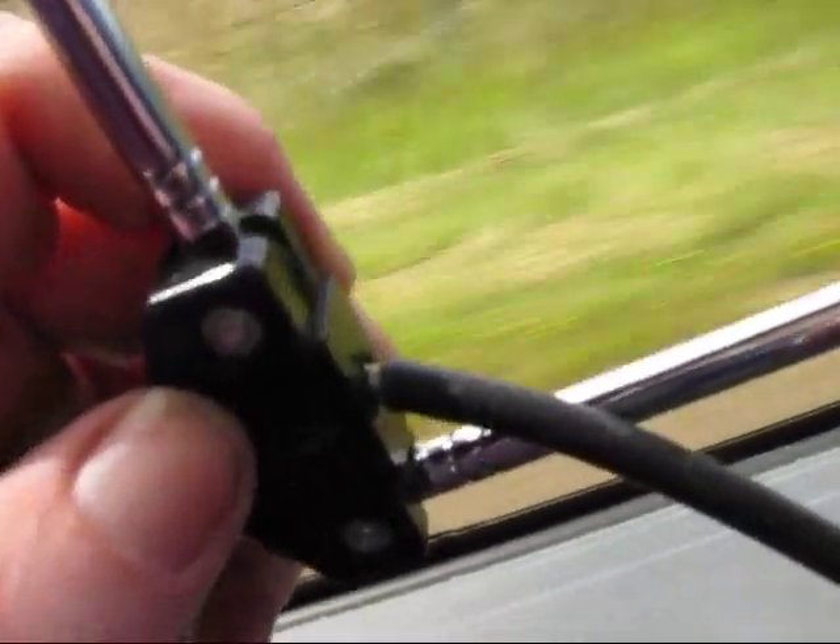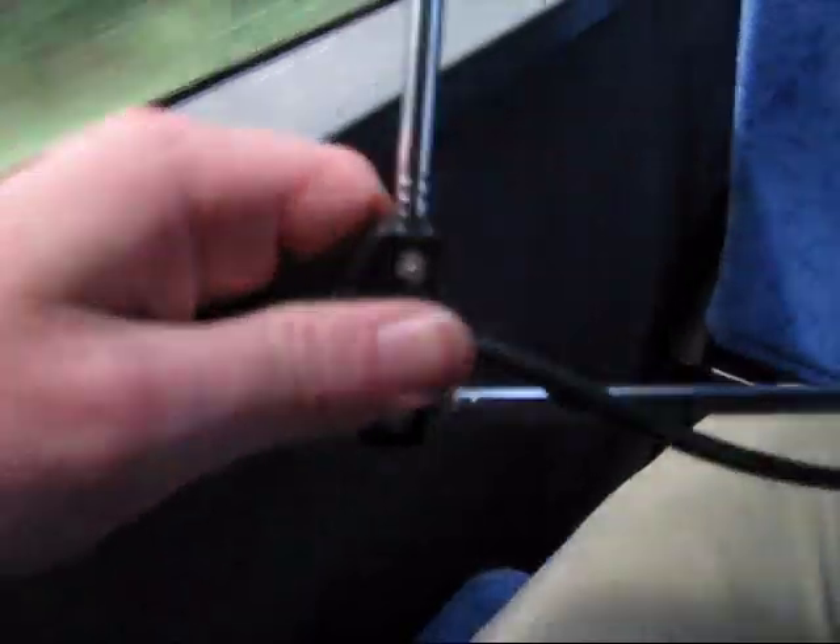It was very easy to modify the rabbit ears — I just needed to drill a hole to put some coax into it, which leads to the transceiver. The length of the shorter section doesn't need to be shortened for 70cm, because using the 2m quarter-wave works as a three-quarter wave on 70cm.